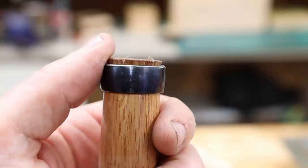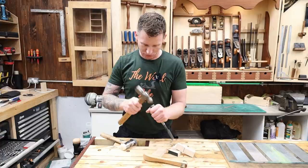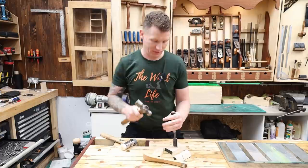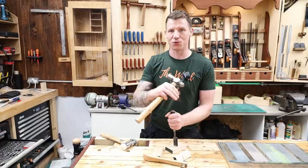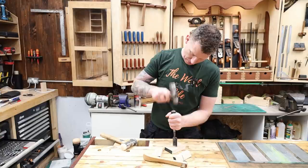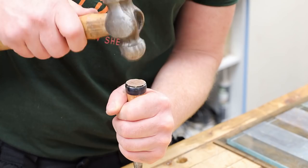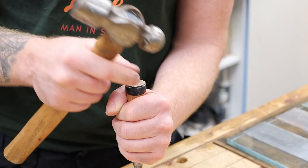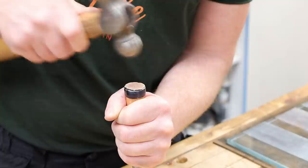About 2 millimeters are now protruding through the hoop — that's where I want to be. Now I want to mushroom over the end of these fibers to set the hoop finally in place. I'm using a ball-peen hammer and working from the center out. It doesn't take much force — just start to flatten out the center and then work out towards the edges, folding those fibers over without splitting or breaking them. Just mushroom them over to catch that hoop.